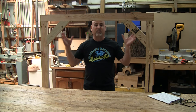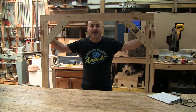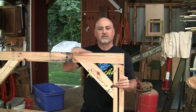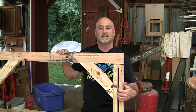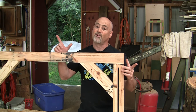I just finished building my hollow log slash tree cookie flattening system and here it is in all its glory. I started by building the rails out of three 8-foot 2x4s. First I jointed it and ripped the rounded corners off. Then I cut some slots in the upright pieces and connected everything together with two and a half inch pocket screws. Love my Kreg jig.